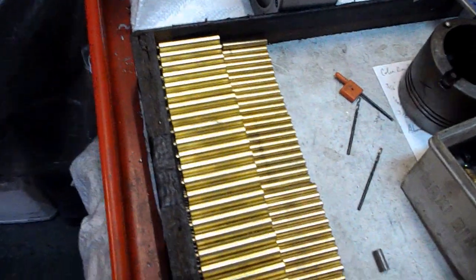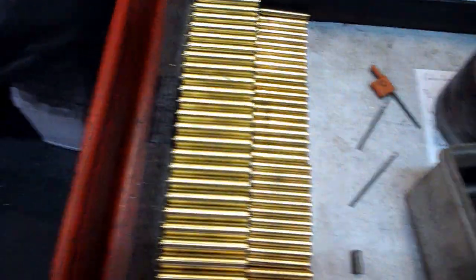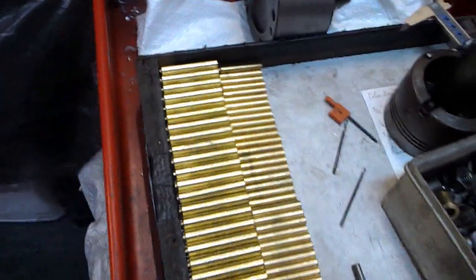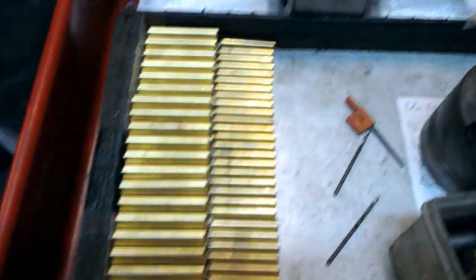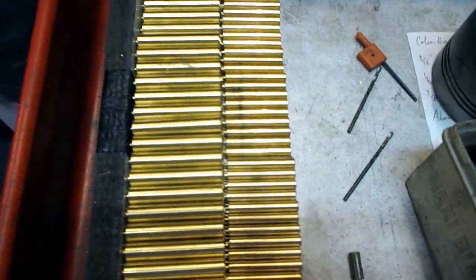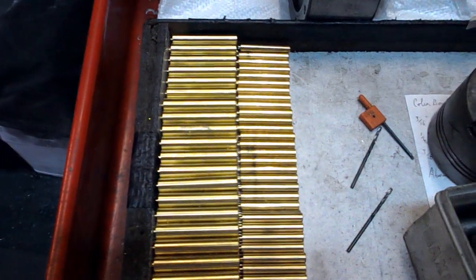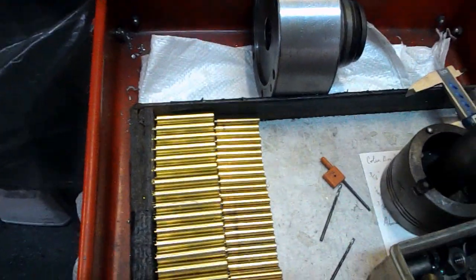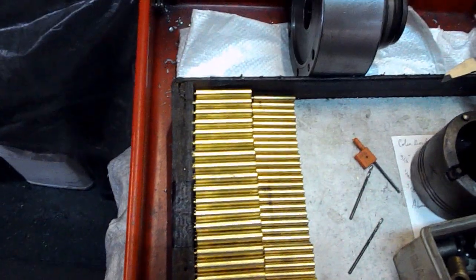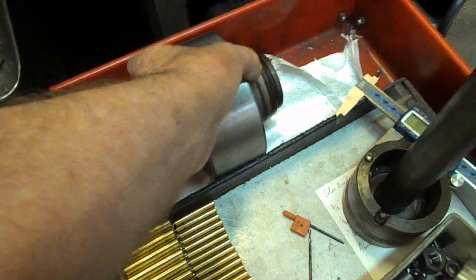We've got to do 100 off in each of three sizes. And we've got the 50mm long by 3/8 diameter ones done, M5 threads. We've got 40mm long with M4 threads done, and we've got left to do some little tiny ones, 20mm long with a 3mm thread, and we don't have the collets to hold the bar. Really, really annoying. To do the bigger ones, we've been using this unit.